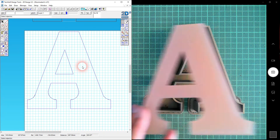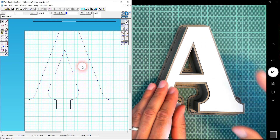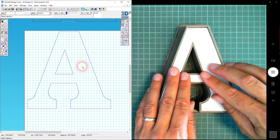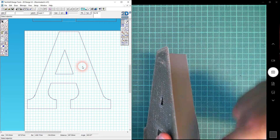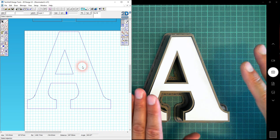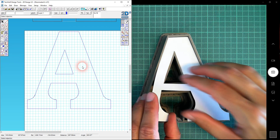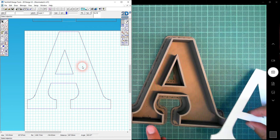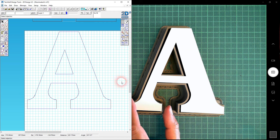The other thing I wanted to show is that I've also laser cut from some thin card the profile of the A, which fits inside the letter — a perfect fit. Because of the way it's 3D printed, the layered grain acts like a ratchet or textured surface that the card pushes down into and locks in place. However, I made a mistake: I neglected to put the cutout in for the micro USB socket, so I'm going to have to fix that now.